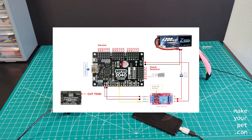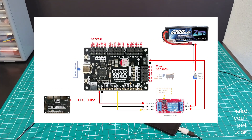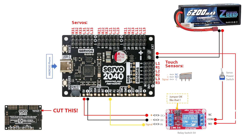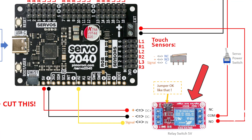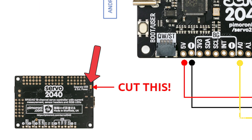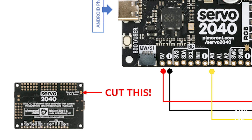The wiring diagram is pretty self-explaining, so I won't get into the details on that. But there are two important points I want to mention. Here I am using a 5V relay, which is what I had and works. But if you are going to buy a new relay, get one that works with 3V, since that's the logic voltage on this board, and make sure to power it from the 3V pin instead of the 5V. Also don't forget to cut this trace on the back of the board to separate the USB from the external power, otherwise you will damage the USB port of the phone.